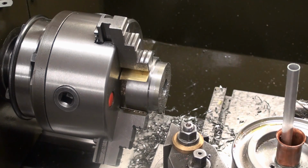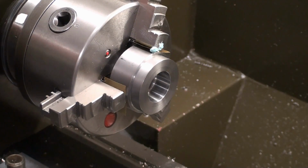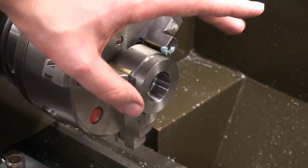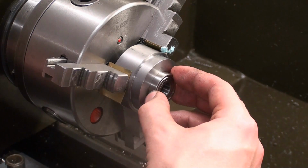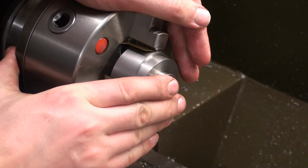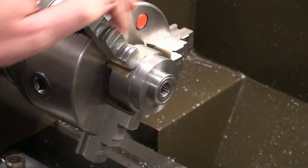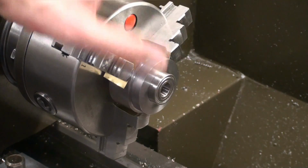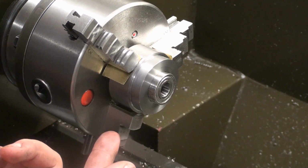And now we can bore out this hole, just with a boring bar. Okay. I turned the first bearing seat off camera, and it's 28.00 when measured, or slightly minus, and I have my bearing here, and it's a very close fit. I could push it in, and I don't get it out right now, but I will have to unclamp this part right now anyway. But you see where we are right now, and now we flip it around and we will machine the second bearing seat.